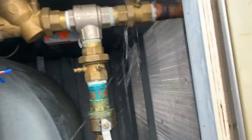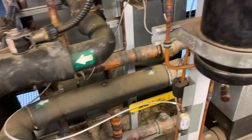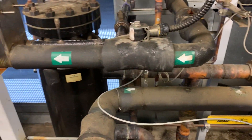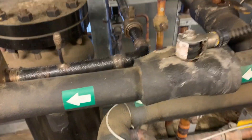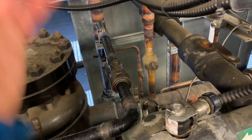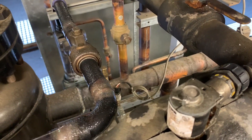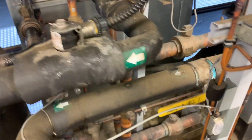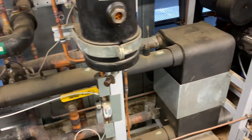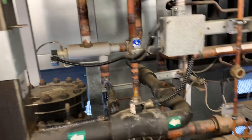You've got a Belimo actuator on the back. Here's another heat exchanger on the rack — this is for the warm fluid defrost, because we also throw discharge gas into the glycol solution for defrost. In that mess of piping, we use that little brazed plate heat exchanger and discharge gas to warm up some of the return glycol coming back.